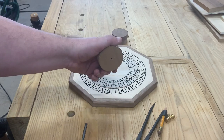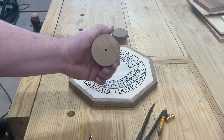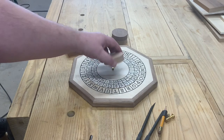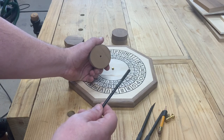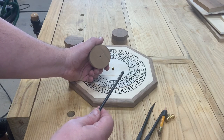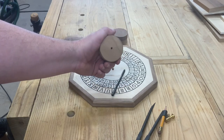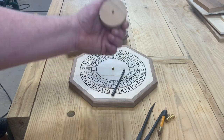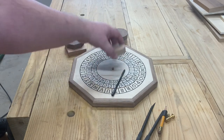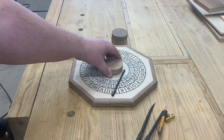This just threads right in with a standard hand drill. You want to go in nice and careful — when you just feel it bottom out, back it right out. These are good for light to medium-duty threading jobs, and this bolt will thread right on. These bits are actually very, very slightly undersized — just a tiny bit — but it's enough that when you get a few turns, they grab really hard. They're designed to do that in wood, so I don't think I'd even need thread locker like I used to put on with the inserts. That's really about it to make these tops.